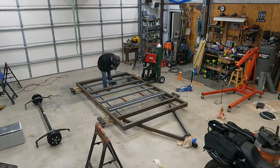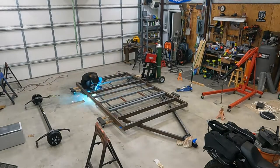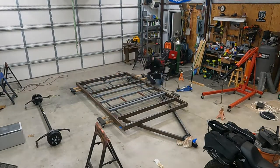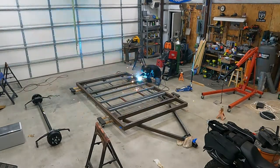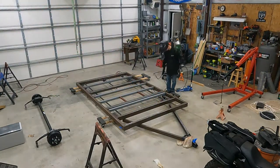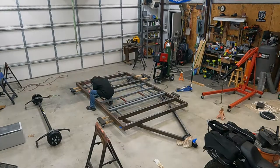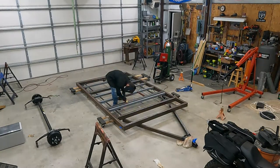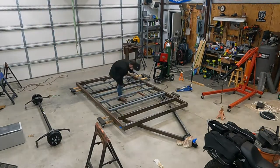There's just too big of a gap, so when you see it arc repeatedly like that, I'm actually just filling that hole in. Then when I'm done I go over it and give it a solid weld — so it's almost like I make two passes at it. I don't know if that's the standard way to do it, but it seems to work out pretty well for me.